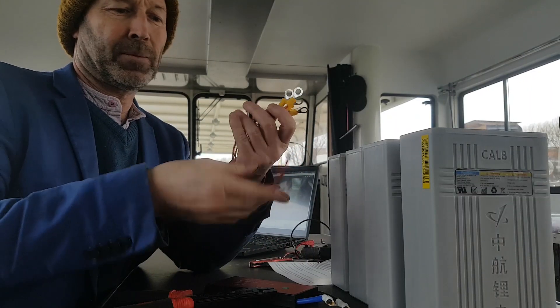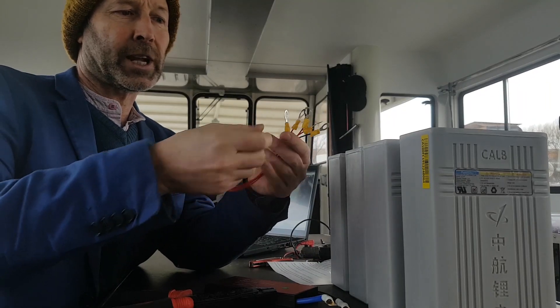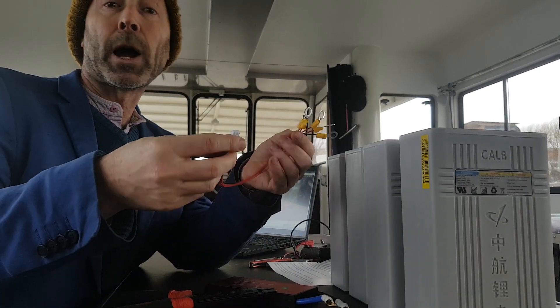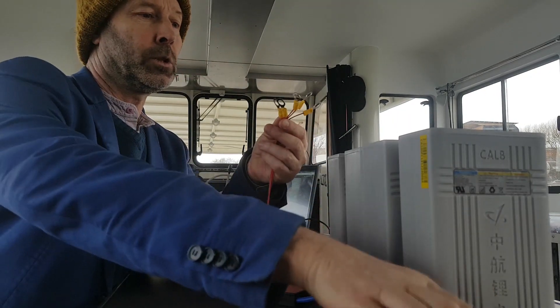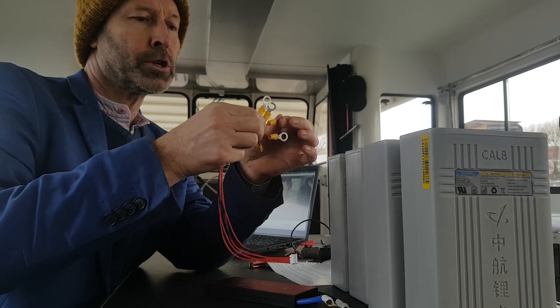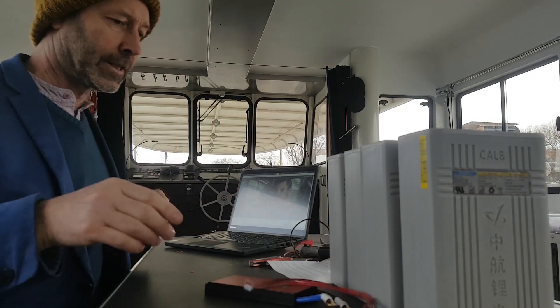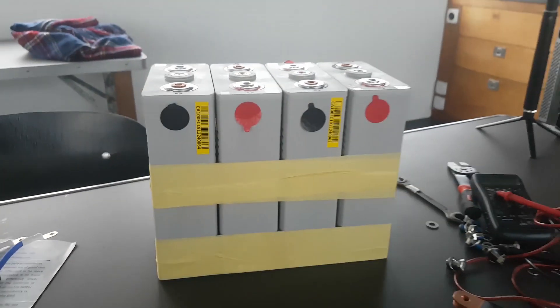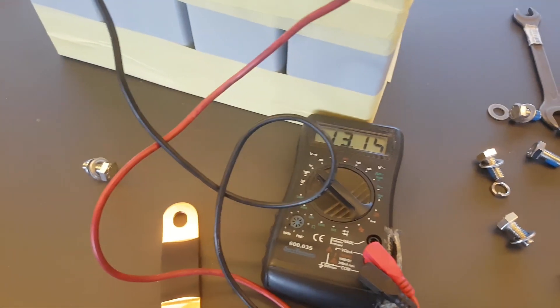I've built up the balance charging cable — I just put a little lug on the end which fits on the bolt. They're quite small wires so they don't need a lot of amperage. Just use a basic crimping tool, pretty easy to DIY. Just check they're all on — all good connections. That then plugs in when the battery is ready to go. Balancing is important, but if you buy from a good supplier the battery should arrive as a balanced set. Mine did. The voltage state of charge was close enough that the BMS could balance the batteries over a few months of use, so no need to do more.